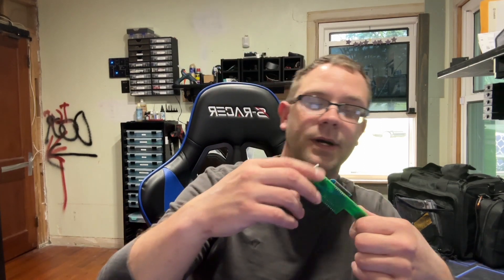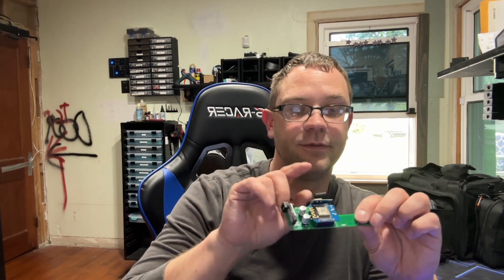Alexa, close the office door. Now that is a much slower version one. This one also has the capability to open the door, which is something I won't put out there — it's quite a bit more involved. Alexa, open the office door. The new one, however, is much quicker. It has a 433 MHz receiver so you can open it with a wireless remote.